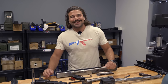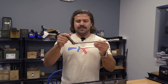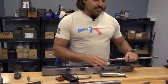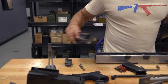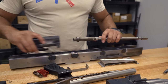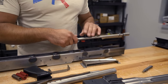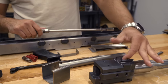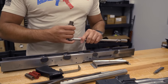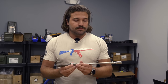Let's talk about the piston. This is our hinged piston — something we've talked about before, but I've never been able to show you in steel. What this allows us to do is disassemble the gun. Once the bolt carrier group is going through the receiver and gets to the rear, the front of the piston is still captured inside the front trunnion. So the bolt carrier can come out while the piston is still in here, and basically come out as one entire whole unit.